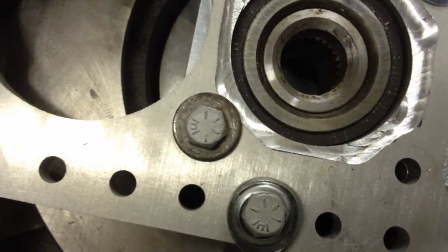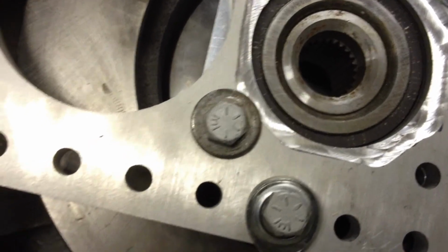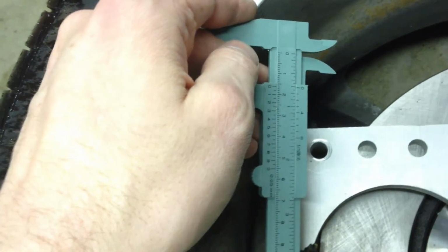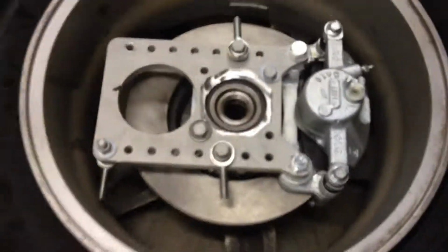Now for the steering clearance, we've got a much smaller amount of run. We have approximately, of course my hand is over it, approximately 16 millimeters of plate. Actually, it's going to be less. See if we can shrink that to make it right about right. Looks like 13 millimeters of clearance all through this system.